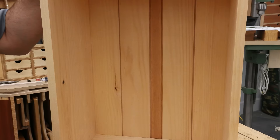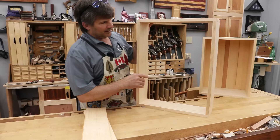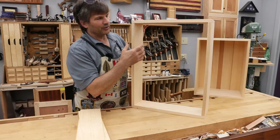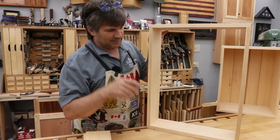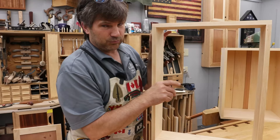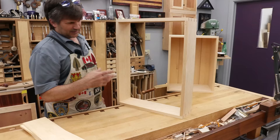So there's three reasons why I'm going with the shiplap back. Number one, this case is going to be made to hold all of my protective equipment - ear headphones, dust masks, and eye protection. So it needs to be somewhat sturdy, which would eliminate a really thin plywood back. Number two, as wide as it is, you've got to allow for seasonal expansion. This is 17 inches wide, so seasonally you could see a quarter of an inch of movement shrinking and expanding on something that size.